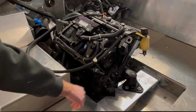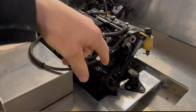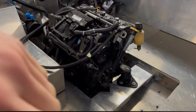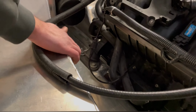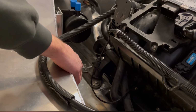Because I remember in the Sea-Doo itself, that mount going to the port side, that rubber could extend out that way, and then it was off to the side of that V hull or whatever. Or that T3 hull. And then these motor mounts were flush with the top of this bracing. So those had to be dropped 3/4 of an inch roughly.